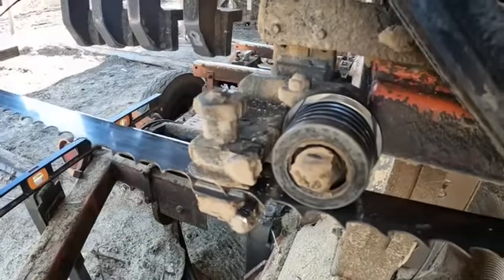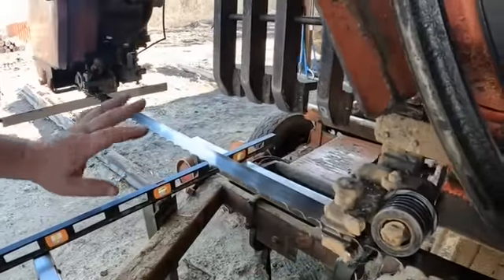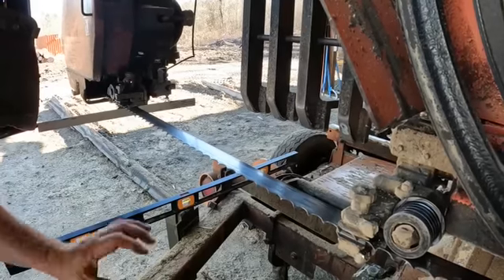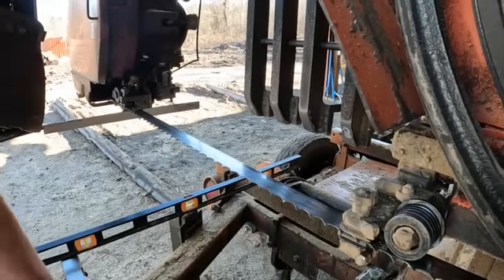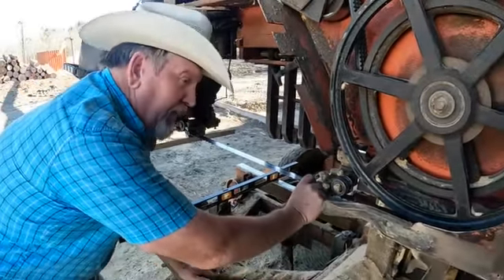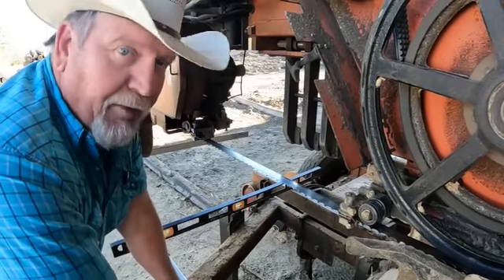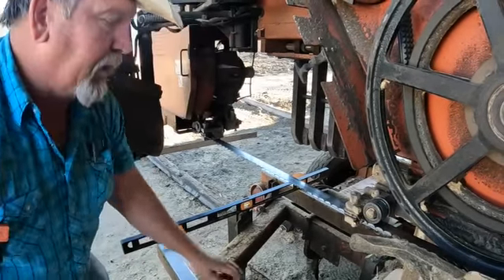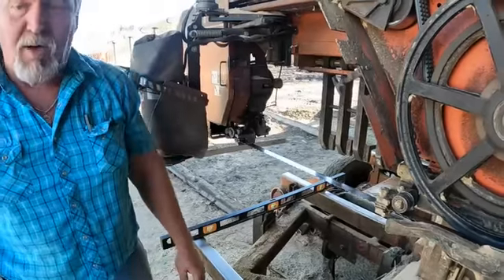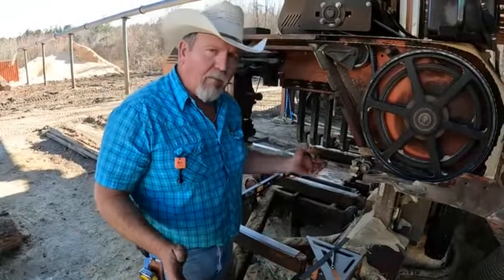With the LT40s, back when I had one, I ran a B56 belt on the blade wheels. The B56 fit a lot tighter and I didn't have to fight getting sawdust inside of them. I know several people who say they don't have the problem with sawdust getting under the belts, but most of those individuals are running older mills that don't have what we call the high-performance blade guides. I think the high-performance blade guides have a tendency to make the sawdust flare and get up underneath — I'm not an engineer, but that's what I'm going to blame it on.